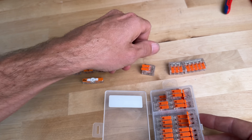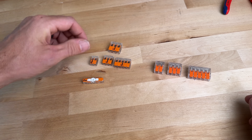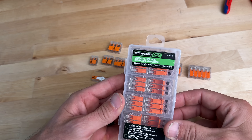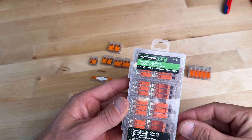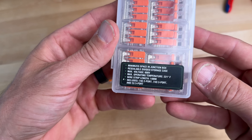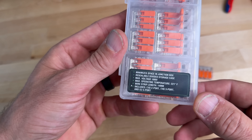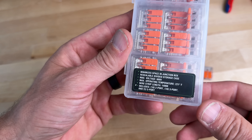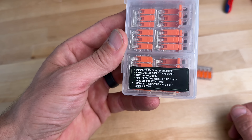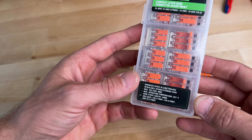Five wire you're going to use on your grounds and neutrals when you're bringing quite a few together. One confusing thing for the Harbor Freight brand is they say here that they're listed to 10 gauge — so 24 gauge to 10 gauge is what they're rated. Here are your other specs: 221 degrees Fahrenheit is comparable to other components such as the WAGO lever nuts and wire nuts. 600 volts is a little bit higher than what the WAGO lever nuts is listed at. This does not list out an amperage rating, which is kind of interesting.